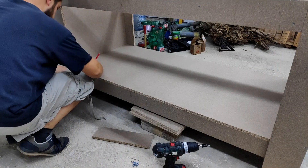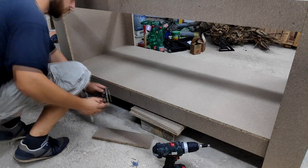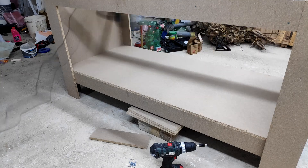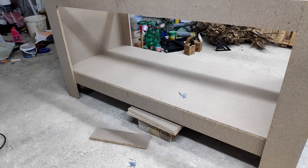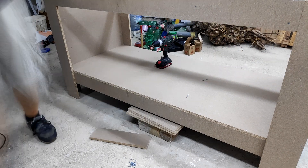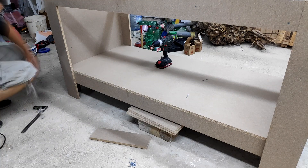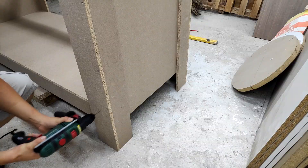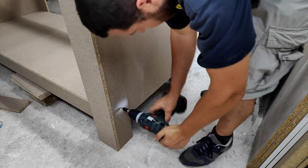I've marked some locations at half of the board thickness along the edge of the shelf and pre-drilled the holes for the screws. I used 50 millimeter long screws here so there is plenty of support to keep the shelf flat. Next I used my speed square to transfer the height of the shelf on the sides, marking some locations for support screws, and I used the drill to make some holes. With the same 50 millimeter screws I joined the shelf with the side as well so it adds rigidity to the entire workbench.